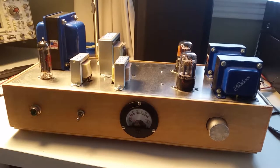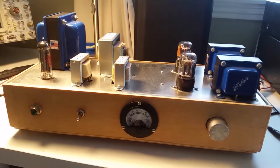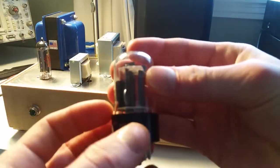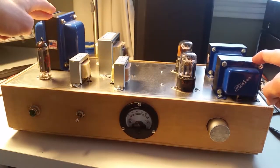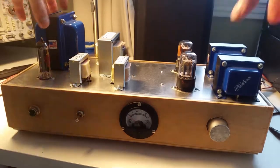Today on the bench we've got my single-ended triode amplifier. This amp uses 6EM7 tubes, which you've probably never heard of before. They are two triodes in one envelope — one is a signal triode and one is the power triode. As you can see, it has a valve rectifier, chokes, and very overkill transformers. This is a controversial design because it allegedly sounds really good but is horribly inefficient — I measured the efficiency at about four percent, which is just ridiculous.